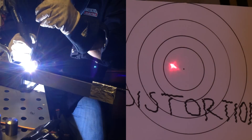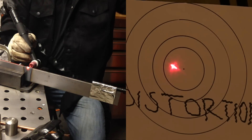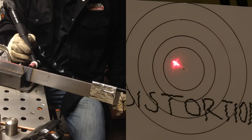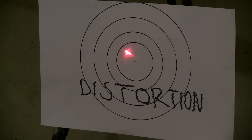You can see it pulled to one side — the side that the bead is on. That's typical; that's what everybody would have guessed it would do. But now it's going to take about a full minute for this thing to quit moving. The red dot starts to creep upward — it's not going to move much more to the side, but it'll move upward quite a bit more because those shrinkage stresses of the solidified weld bead are going to pull it upward. See — it's pulling upward much more than sideways.